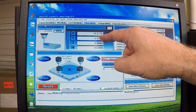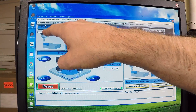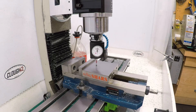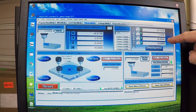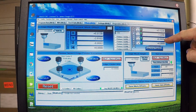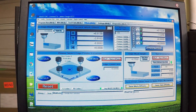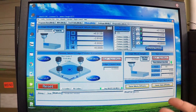So what we're going to do is zero our work coordinate system using that tool and that known length. It doesn't actually matter if that length is exactly correct — as long as it's sufficient that we aren't going to have any negative-length tools. Since we're going to measure off of our work coordinate system, all tools will be relative to whatever we have on this tool. To zero the work offset — I have work offset one, which is G54 — I've set this up so you can enter a gauge block height and set Z based on the current position. I'm directly on the surface, so I've got zero entered and I'll click Set Z. My Z coordinate in my current working system is now zero, with tool 99 selected.